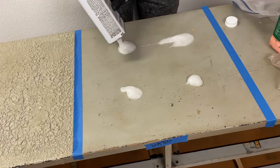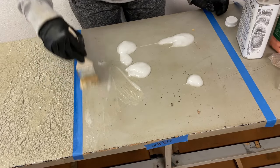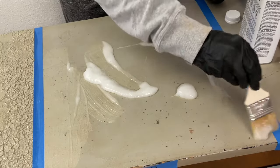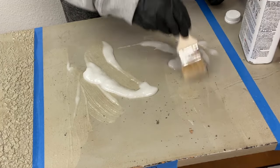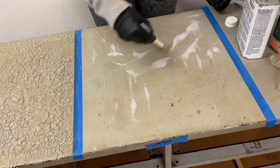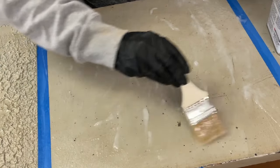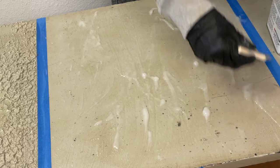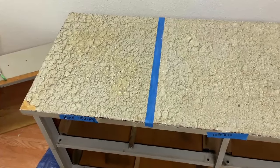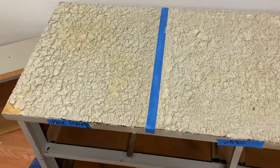The Watco brand stripper was applied in the second section. The thing I immediately noticed was that it came out of the container in big blobs and it didn't seem to go on as smoothly as the Quickstrip. As a result, I don't think I got an even coat across the entire area, so after 10 minutes I had to apply a lot more stripper to fill in those areas that were not reacting as much. It did appear that I used more Watco stripper than Quickstrip to cover the same area. The Watco began working just as quickly as the Quickstrip — both began to make the finish look like alligator skin before my eyes.